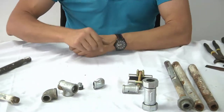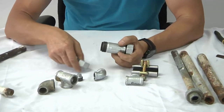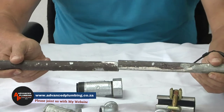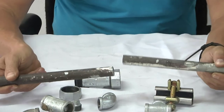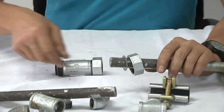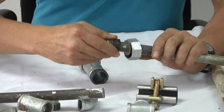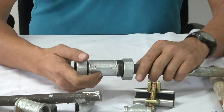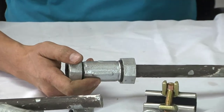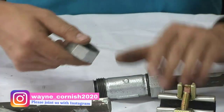In order for your fittings not to leak. Then we have a Johnson coupling — another nifty little fitting. Picture this: you have your galvanized pipe and you've sprung a big leak in the middle. What you do is cut your pipe in half, push one pipe slightly over, then take this nut and put it over there with the ring. There's a little gasket inside that you push right over — make sure it goes on tight. Take this and push it halfway through, then tighten this nut with a box-end spanner. I'm not going to tighten it in this tutorial as this is only for demonstration purposes.